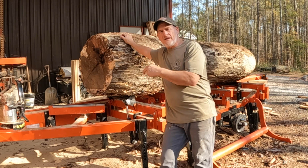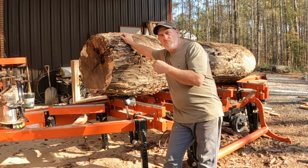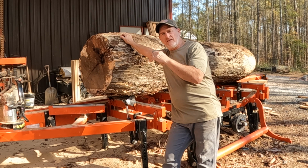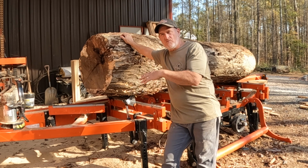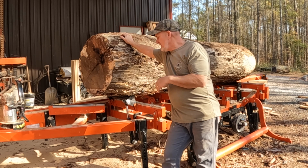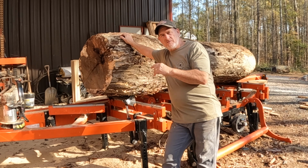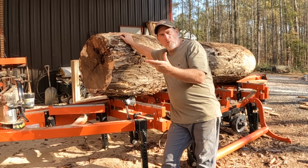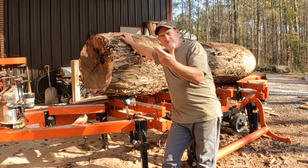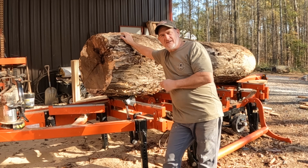It does have a little rot going through the middle of it, but we think we can cut that off and get a lot of good white oak lumber left in this thing below that rotten spot. And just gonna probably mill it up into a few slabs and probably some 1¼ inch boards, 5/4 boards, for using something later on.